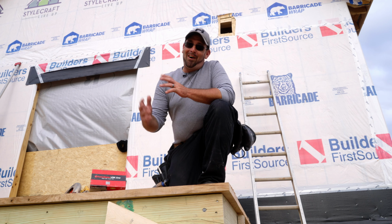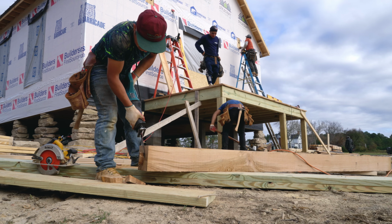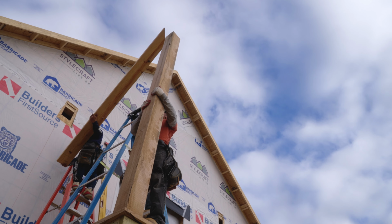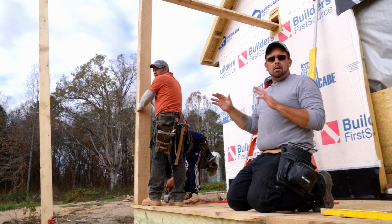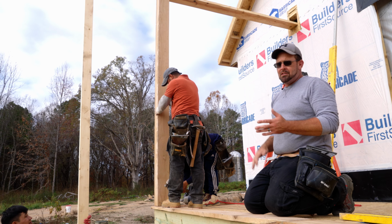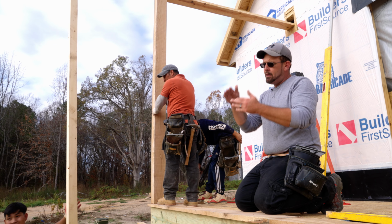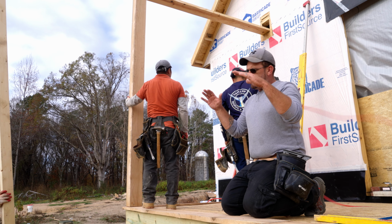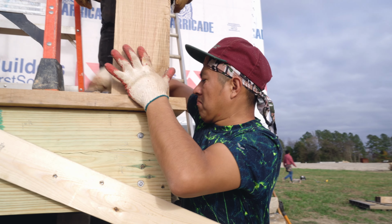We're moving right along. So now on to the porch beam and roof system. We're getting our porch beam installed, and we're gonna be using a box beam type of format. So we're gonna have a 2x8 on the bottom, a 2x10 on each side, and another 2x8 on top. And we're gonna interlock those breaks and changes so that they will all tie into each other and there's no way to pull or separate at any time.